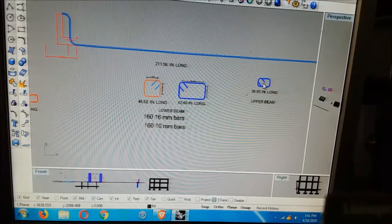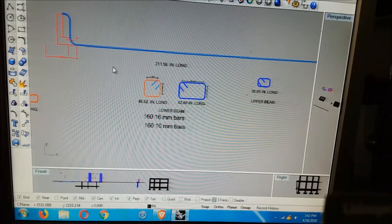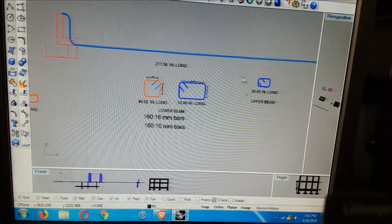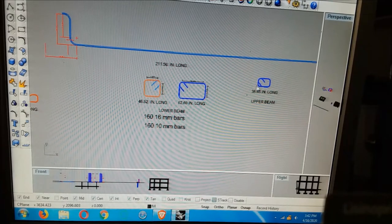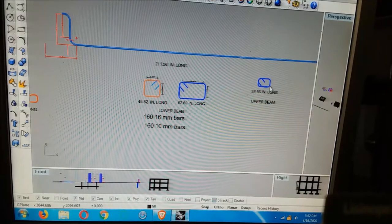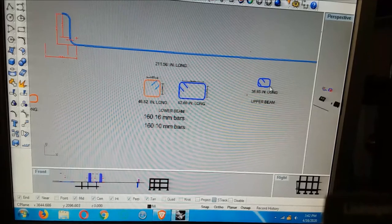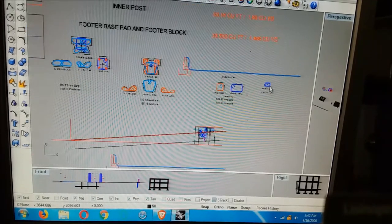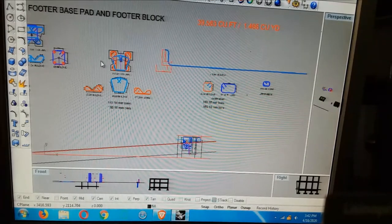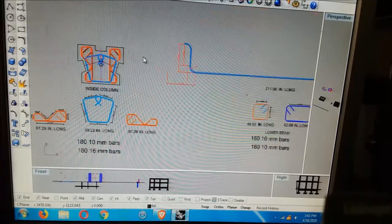This is when the walls are poured, the top tie beam and the wall were one monolithic pour. So it's got rebar in it as if it was actually a beam with no wall underneath of it. All the calculations assume it was sitting in air, but the poured concrete wall was really holding it all up too. This up here is the rebar, just like we just counted, like 20 of them in one of these columns. This is what goes down in the ground.